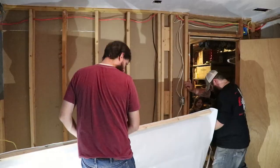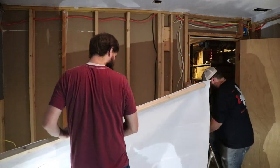I prefer white in here for a lot of reasons, as far as the paint scheme. White shows when stuff is dirty a lot easier than most colors. We also wanted a lot of white in here for the video production because the white balance is a lot better. We used plastic sheeting on the walls that have the wooden studs. The block walls we just painted with the same wipeable waterproof paint that we painted the shelves.